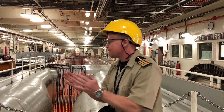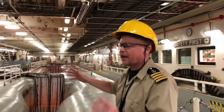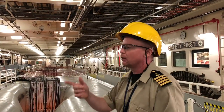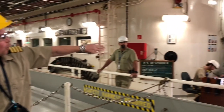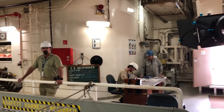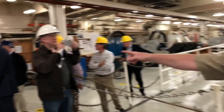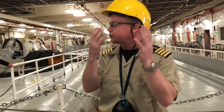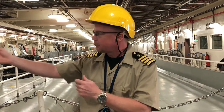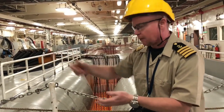Okay. Let's start with the beginning. Each of these cable tanks is loaded with cable. The way cable works is, like the old days, it's loaded through these cable ports on the side. Came up the gangway, right here this door opens up, and the cable would be fed through there into these little transporters, which is right behind this gentleman, or right here is a transporter as well. The cable goes through that, it opens up, there's a belt that pinches down on it, and that pulls the cable from either a freighter, or if we're at a particular factory, our factory will send it. It gets picked up by this transporter, pulled in, comes into the vessel.